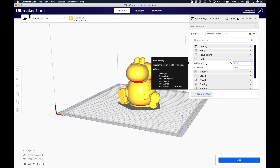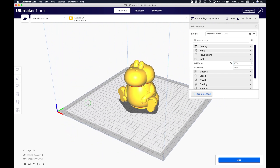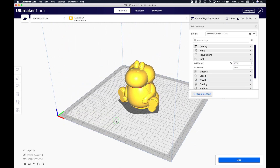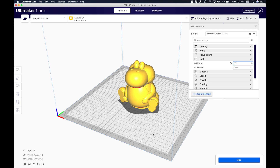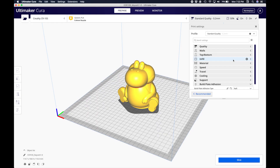The infill density refers to how much material is being used in between the walls of a print. Looking at our print here, we can see it's very wide, and on the inside we can control how much material is inside. At 100% density it will fill 100% of the inside, and at 50% density it will fill 50% of the inside, through several different 3D printing patterns. One other thing to note is that you cannot actually change the material within the slicer software — instead, you just set the printing and build plate temperature specifications for the type of material you're going to use.